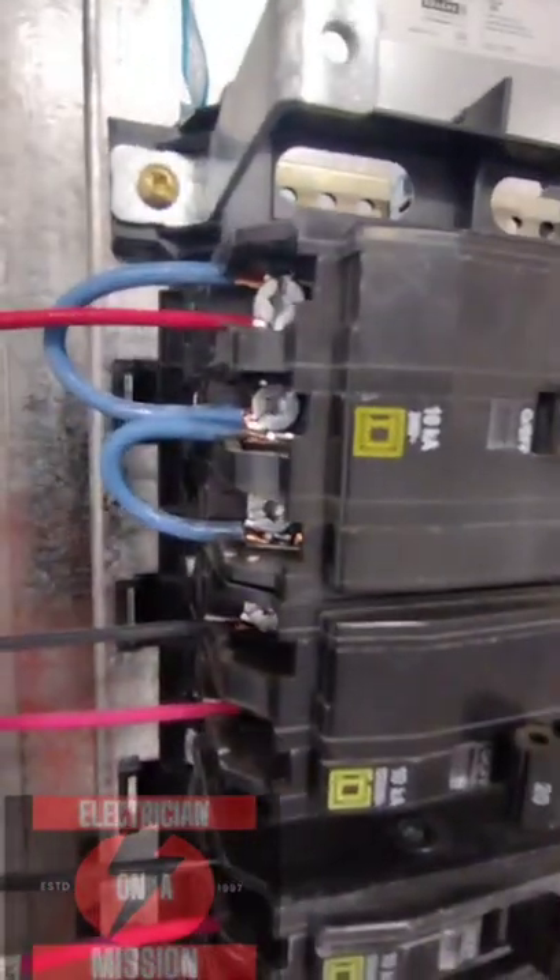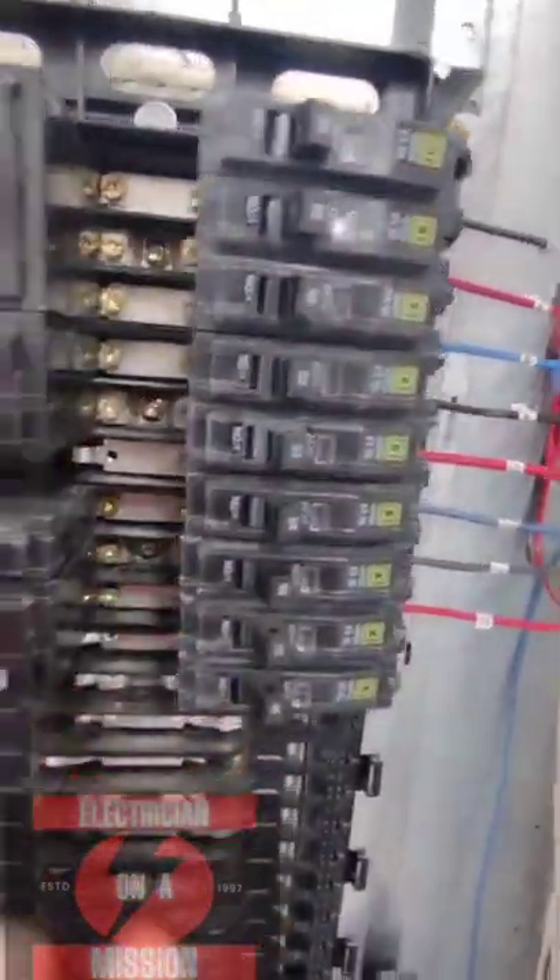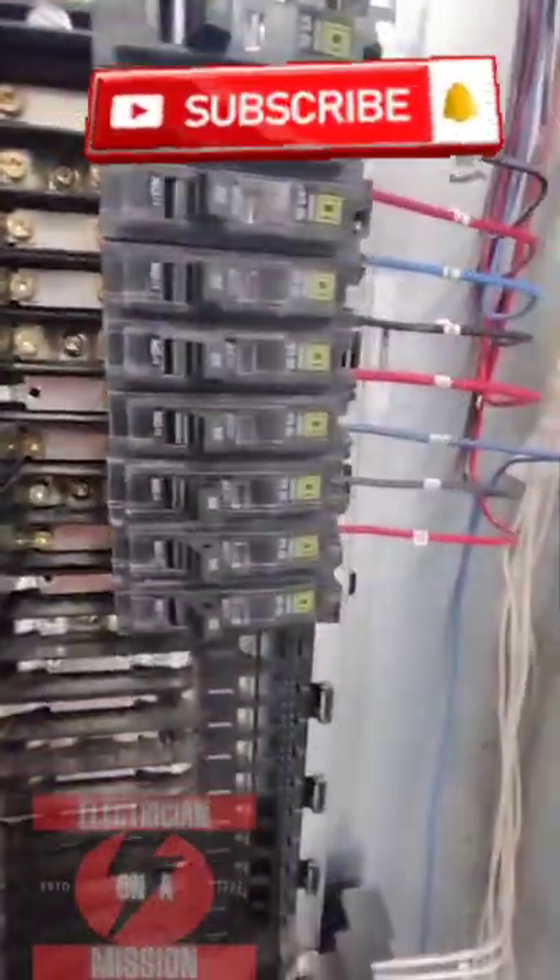All this is hot. I was able to light up every phase off of one hot. What I did was take a 30-amp breaker, back fed it to light up every phase — jumper throws, bam, every phase is lit.